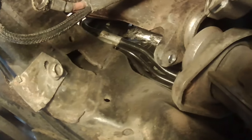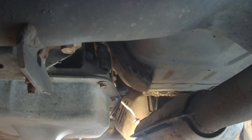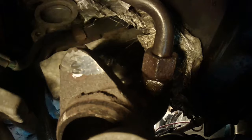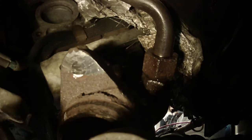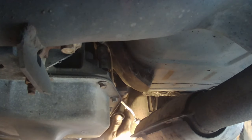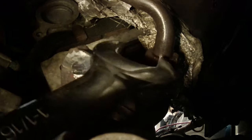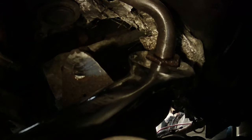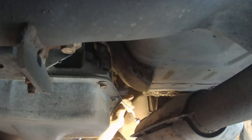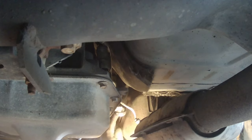Now we've got that loose. Looking at it from underneath you can see where the bolts were cut. If you've been following along till now, this has been really fun — and it don't get better. This EGR tube pipe takes a one-and-sixteenth inch wrench. You can just barely reach up in there, and needless to say it's not going to just turn loose. Without a wrench on it, it's not even thinking about it — clearance is next to nothing.